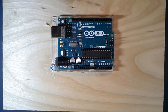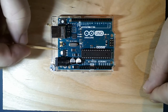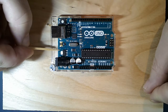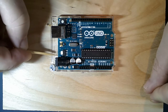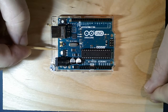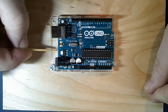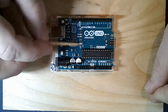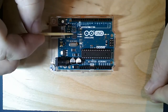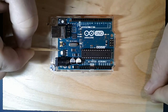The circuit board, also called the printed circuit board (PCB) or printed wiring board (PWB), is made of FR4 - flame resistant 4 material, with FR4 meaning formula number four. If any component catches fire, the whole board will generally be flame resistant because it's made of fiberglass and epoxies that hold the board together and give it a nice stiff structure.